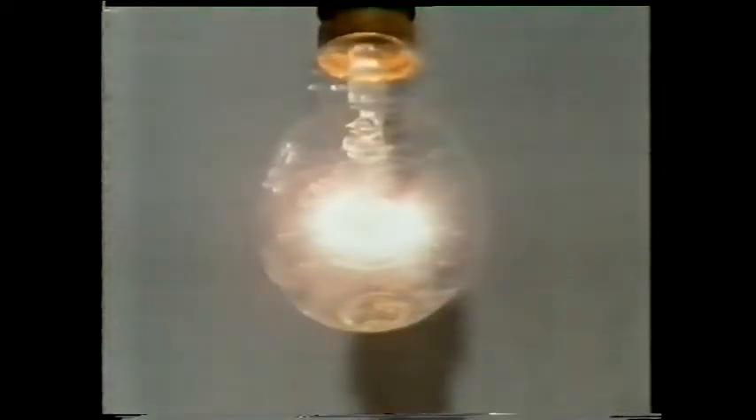The same thing happens in this type of electric light bulb. Inside is a coiled filament made of tungsten — when a current is passed through it, the tungsten offers so much resistance that the coil glows white-hot. And every time you use a toaster you rely on a metal conductor getting hot as a result of the resistance it offers. An electric iron is also heated in a similar way; here the heating coil is contained inside a metal tube cast into the base plate. The coil is made from a very high resistance material. To insulate the coil from the metal casing, a fine white powder known as magnesium oxide is used, which is also resistant to heat.